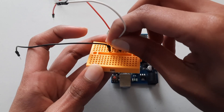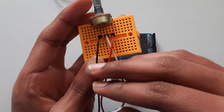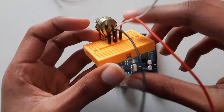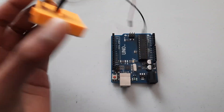Take the white wire and put it right in the middle of both. If you move these wires out of the way you can see they all have a one-row gap in the middle, and that gap corresponds with the gaps between the pins on the potentiometer.